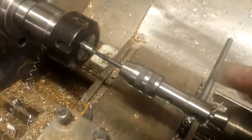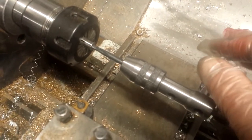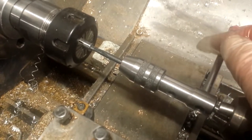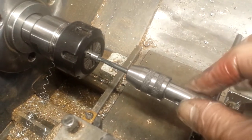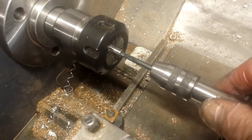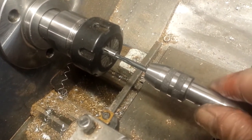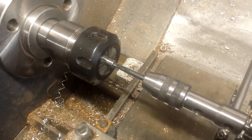Now we're making the cylinder pivot — it's going to be a composite pivot, which someone showed me how to make. It'll be easier to explain once I've made the parts. Right now I've drilled and am tapping an M4 thread into a piece of 8mm precision ground mild steel as one of the components.